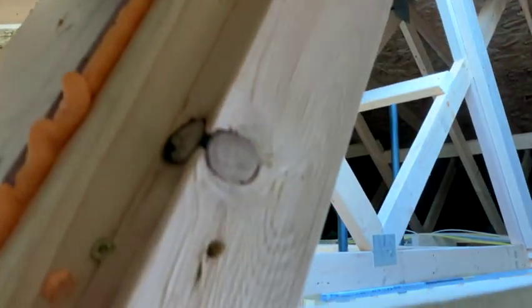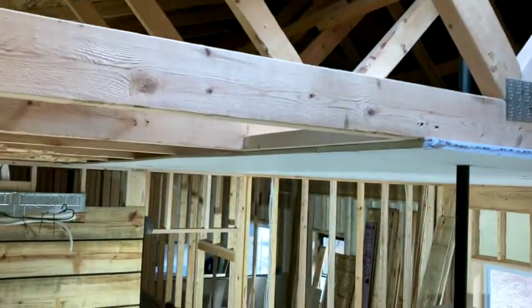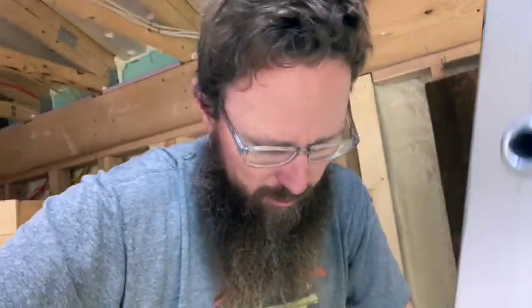All right, so I filled all my gaps and cracks around that whole perimeter. And then I also did on the front, if I can show you this little bead up there on the bottom, and then the gap that was in the top up there by the skylight. It's one of the cool things about that Great Stuff gun is that you can have a lot better control over it. You can get a lot more precise with that bead of foam.